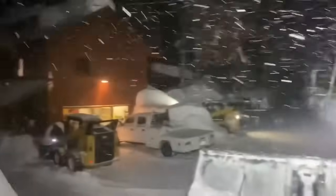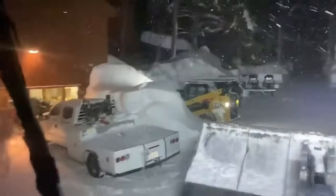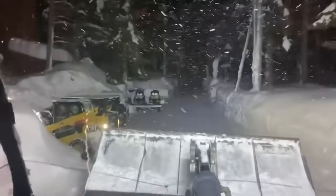This loader is definitely keeping me on my toes. It's this snow business — it's always something. Now I gotta go back to the house and see if I can figure out what that warning light is. Hopefully it's nothing too serious. It seems like the alternator is not charging, or I might have actually lost my belt or something. We're gonna check something real quick and figure it out.